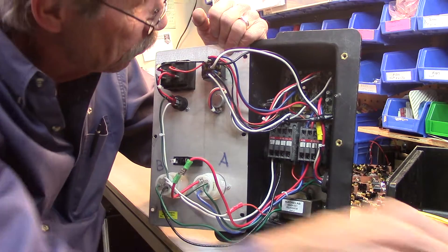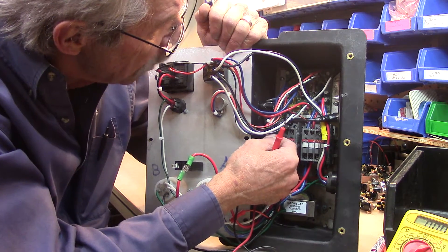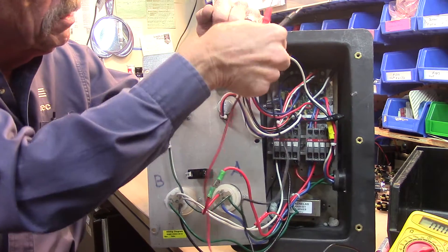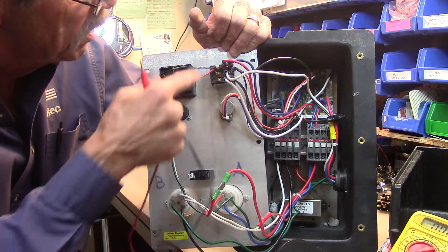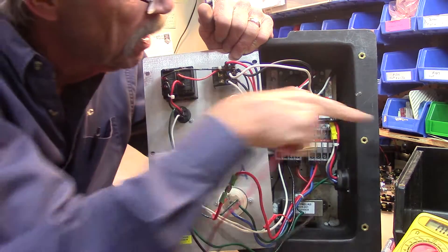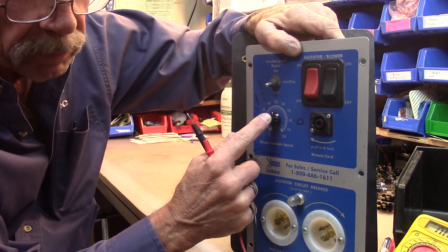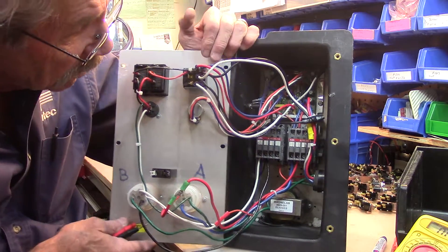Now, a function of the fuse holder in the machine. One wire from the contactor goes into the fuse holder and it comes out on two wires. One of them goes to the bottom corner of the variable speed bypass, and the other wire goes to your speed control unit. Then the wires from the speed control end up coming into the top two wires when you have the switch selected to run the speed control. If power comes in there, the switch has to be all the way down — that then lets the power go out through the common wires and out to your blower motor. If your speed control unit is not working and you're sure the switch was in the right position, then chances are either the potentiometer is bad, which is rare, or the speed control board in the back is burnt out, which is probably the most common issue with speed control not working.